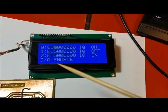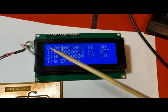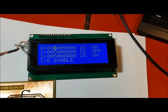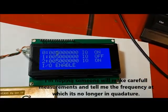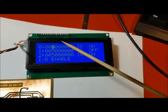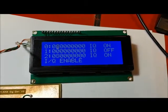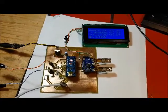The quadrature output is hard-coded to support only 3 MHz to 80 MHz. Below 3 MHz, quadrature cannot be achieved. Above roughly 40–50 MHz, quadrature starts slipping and the outputs are no longer truly 90 degrees apart, even though the hard limit is set at 80 MHz. That concludes the introduction to the PARC Siggen and its features and functionality.